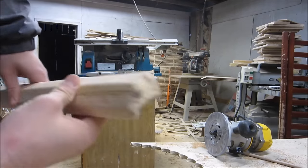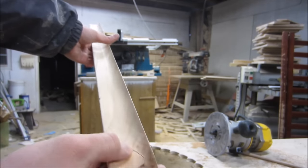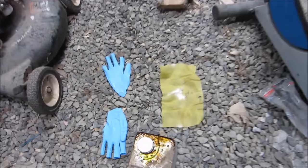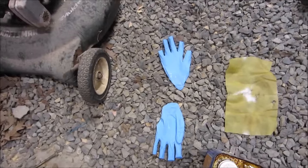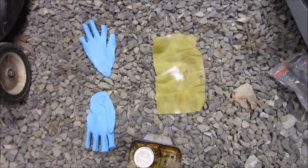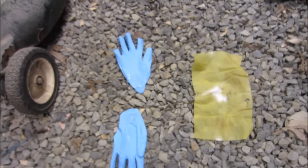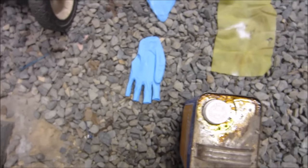This is a cool profile — turned out well. I'm going to finish off with a 220 grit and then put a little linseed oil on it along with the other part. Here's the finished product with the linseed oil on it. I'm going to have to give this 12 hours or so, probably all day. Some safety about linseed oil: there's an oxidative reaction which is what causes it to dry so fast, but it can also potentially, with exposure to oxygen especially when it's wadded up, cause a big fire. So what I like to do is stick it in a spot with nothing that can burn around it — this is just some gravel area in the back of my barn.